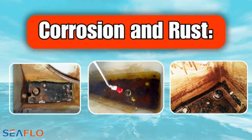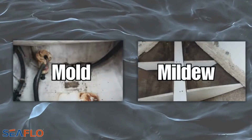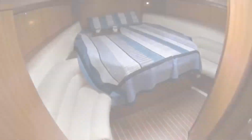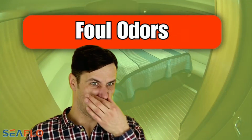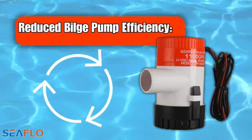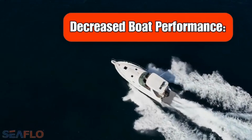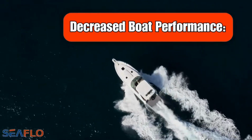Standing water causes metal components such as the hull and engine to corrode and rust. It also creates a damp environment in your bilge, promoting the growth of mold and mildew. Stagnant water mixed with fuel and oil produces foul odors that permeate your vessel's cabin, creating a negative boating experience. This standing water also causes your bilge pump to cycle more frequently and reduces its lifetime and efficiency. Standing water left behind by your bilge pump adds unnecessary weight to your vessel, affecting your boat's fuel efficiency, performance, and stability.